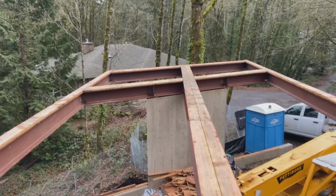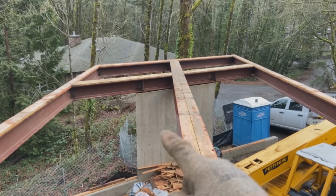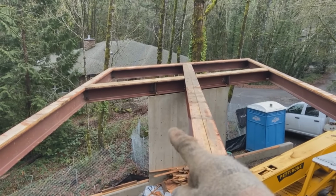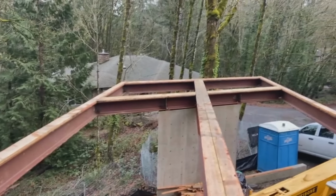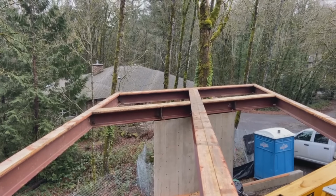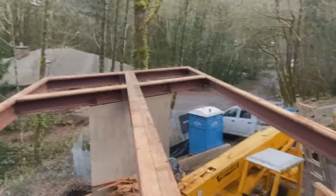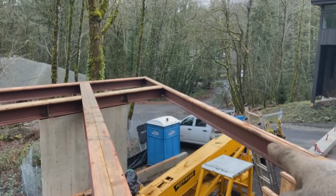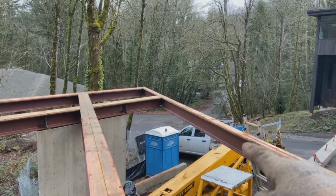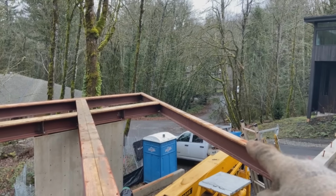So I'm guessing he wants the shear perpendicular, square to that grid line axis there, which is what it'll be. So we'll be decking across the joists square, but it'll look like it's crooked in this area. So I have to lay these out. It's 19.2 inch centers, so it's 5 per 8 foot sheet versus 6 with 16 on center, or 4 with 24 on center.